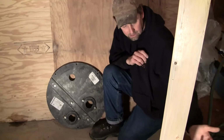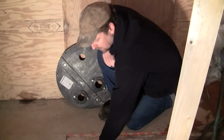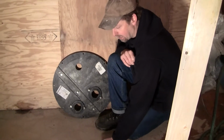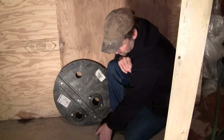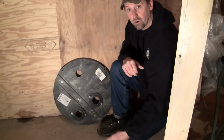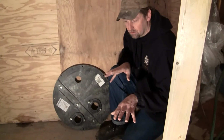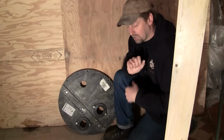So again, back to the other option, quoting the Mike Holmes book, it's 1.5 or 1 inch styrofoam, depending on your ceiling height. The thicker, the better. 1 inch is what's recommended, and then 5/8 plywood on that, and then your flooring on that, eliminating this issue where you have moisture trapped in between products. And being 2x4s from the lumberyard, naturally they'll have moisture in them right from the day you buy them, and that moisture has to get out. So if you use manufactured products to do your basement properly, without moisture in them right from the very beginning, then you've eliminated that issue.